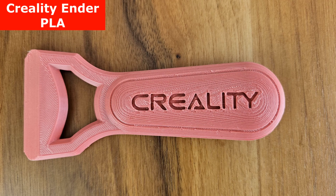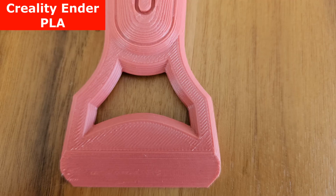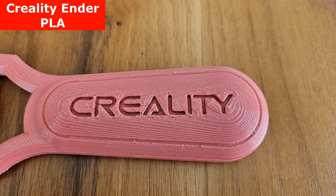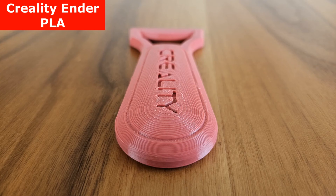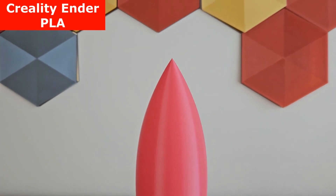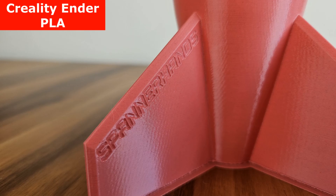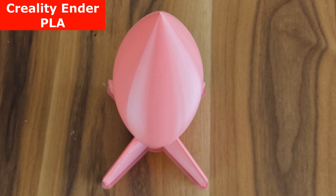I'll say similar things for the spatula model — again a quick printing done with Ender PLA. There are slight rough spots on the front part, but otherwise I see no printing issues. Probably a layer height over 200 microns was given, that's why the layer lines are noticeable. However, overall it has been a nice and successful printing. The next one is a rocket model printed in single wall vase mode at a layer quality of 0.2 millimeters. It's an easy model to print, but here we can get information about both the filament's diameter consistency and observe the printer's layer quality. It seems that both look pretty good on this model. I also print this model so you can see the maximum printing height of the printer.